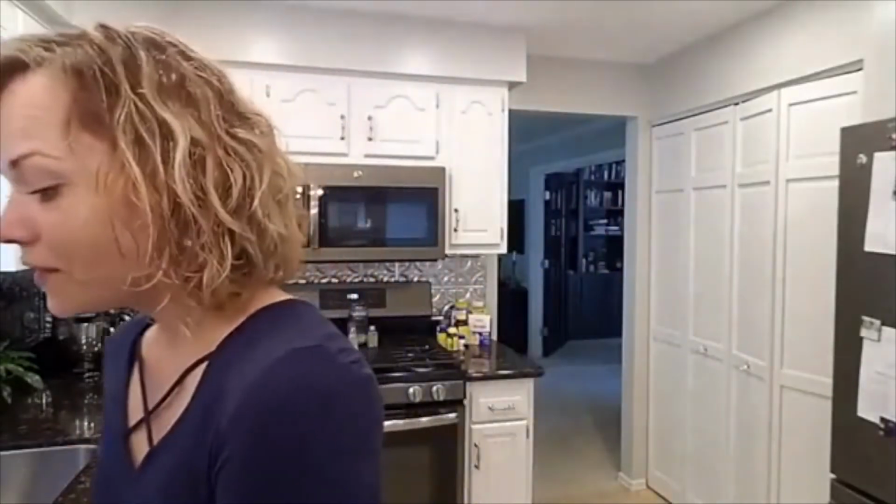But just as a quick reminder, let me show you what we did to this kitchen to turn it from oak, honey oak cabinets, like the good old builder grade oak cabinets, to pure white. This is what we did. I used 2 coats of primer. Now, this is going to show up backwards here until I flip the camera, but hang tight. We use Zinsser primer. This is a shellac-based primer. It stinks, but it works really good.